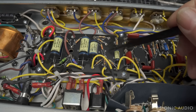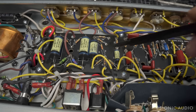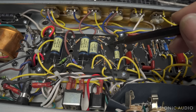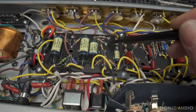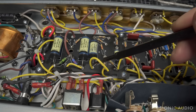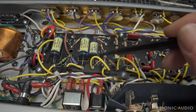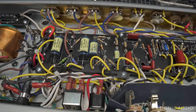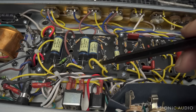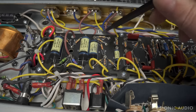The board itself is fiberglass, and in parts, like over by the reverb stuff and the fuse holder there, it is a PCB. In other parts, it has eyelets. Not real substantial eyelets, but actual eyelets, and it is wired to the eyelets with bits of wire rather than printed circuit board traces. To me, it would make a lot of sense for this amp to have some more integration of circuit board traces so that it could avoid the spaghetti, because this amp has a lot of spaghetti.